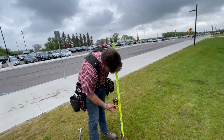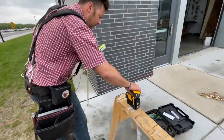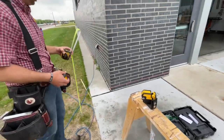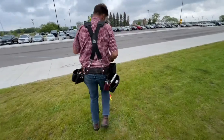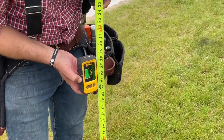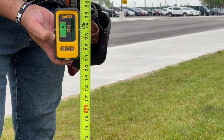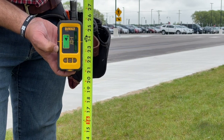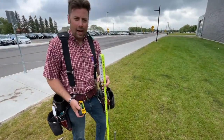The receiver isn't facing the laser, so we swivel the head — it only has about 160 degrees of radius. Now it's more pointing our direction. We read 23 and 5 eighths. That means our line, if extended further, is down three-eighths of an inch. If we're 23 and a quarter there and 23 and 5 eighths here, we're down three-eighths.